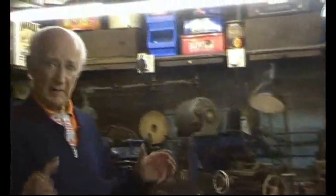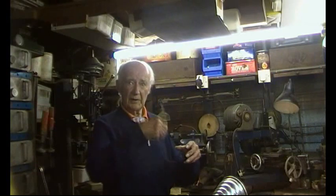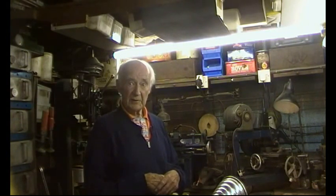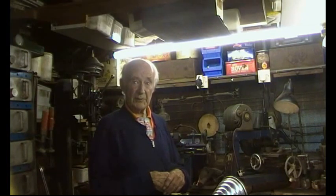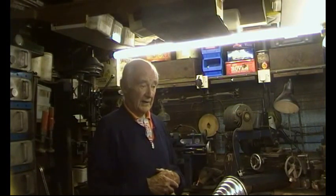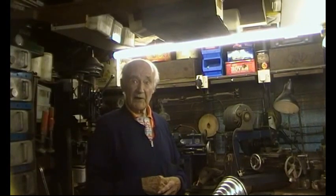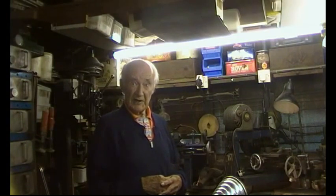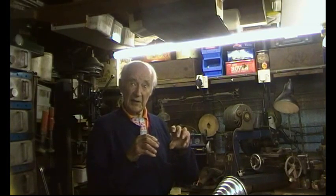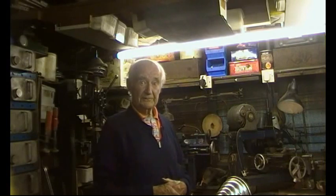I had a friend who bought a big massive joiner's vice — a proper big industrial one, really cheap — but it was all taped up from an auction sale. When he got it home and undid the tapes, there was no nut or quick release mechanism, so it was absolutely hopeless. That's why it was so cheap. He came to me and said could I make him a nut. Well, it was an almost impossible task to make a half nut for that. So what I did — I cast him a nut in situ in the vice itself. And eventually he sold that vice to a commercial joiner who would use it daily, on my aluminium nut. Now that of course was a very coarse thread, like an Acme thread type thing, which was ideal for making an aluminium nut. So that saved the day for that one.